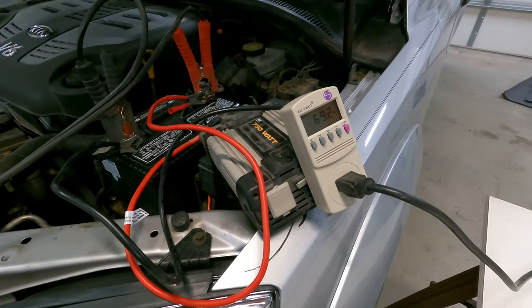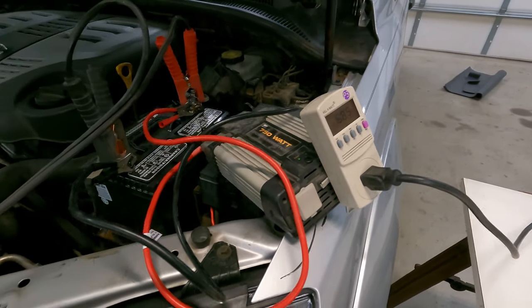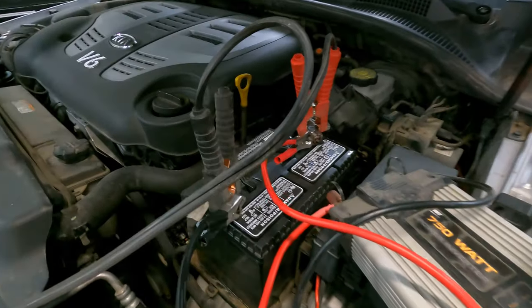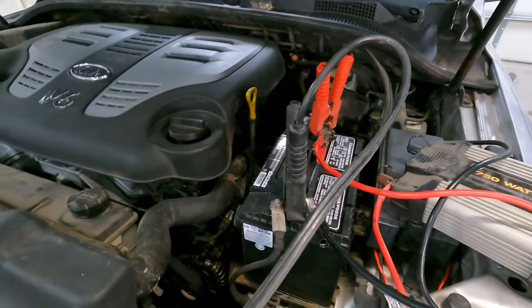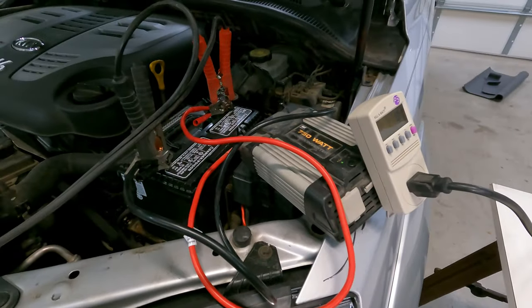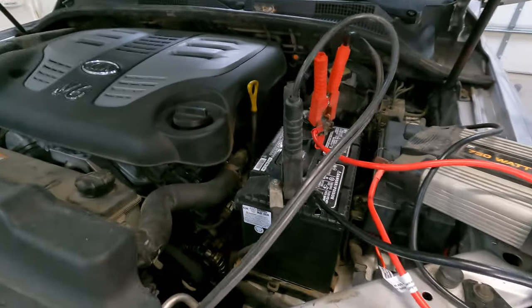I'm really curious to see if — for instance, if I were going on a long drive and wanted to keep drinks cold — I could run a mini fridge in the back on a power inverter. That's kind of why I'm doing this test. According to what this thing's saying, roughly 70 watts, one amp on the 120V side converts to 12 amps on the 12V side. That doesn't seem like it would be that significant of a draw. Usually these vehicles have maybe 100–200 amp alternators. If you were running a diesel with dual batteries and the high output alternators that come on those, this wouldn't flinch it. But for a small economy car — this is a Kia Sorento — I'm not really sure it would have that crazy of an alternator in it.